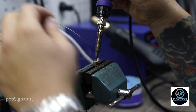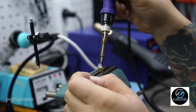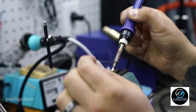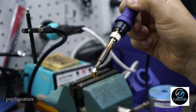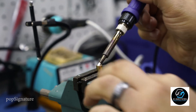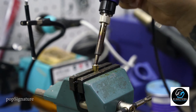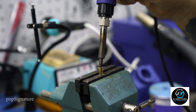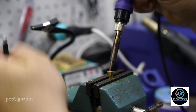Once you see it boiling up and the solder starts to reach the level of the side hole, bring your iron toward the top to get a little bit more on the sides. Let it sit there until it gets nice and hot. You want to make sure the bottom doesn't cool off too much, otherwise you're not going to get a good joint.